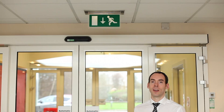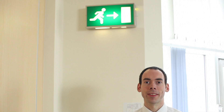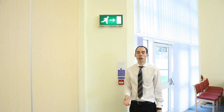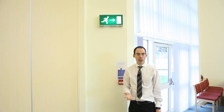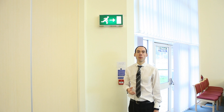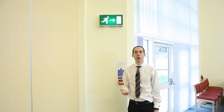Emergency lights look like this — they come in various forms. Emergency lights are basically just a light that has a battery backup. Under normal conditions, electricity is going into the emergency light and into the battery, powering the light and charging the battery. In an emergency situation the power would be cut and the battery would be activated — and that's how they work.